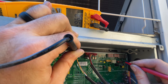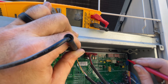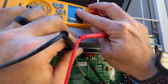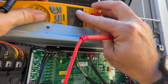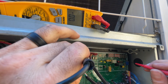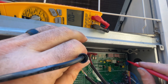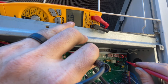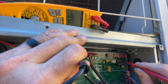All right — we've got five volts right there with the switch in the on position, so this switch is actually not working. What I'm gonna do is flip my meter around to micro-amps DC, and that's just gonna make it act like a jumper basically. I'm gonna go to my ground point and touch this pad right here. You can see I'm pulling a little bit of current off the chip.